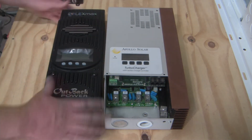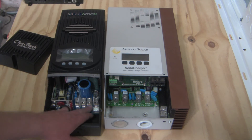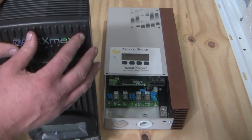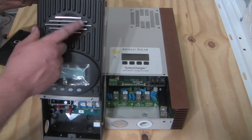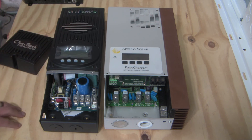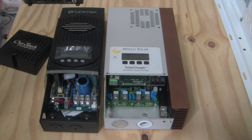For comparison, this is an Outback 80 — it has 150-volt input. I consider it to have pretty good terminals, but they only accept number two wire. Comparatively, look at how much more room you have in the Apollo. And then look at the fan — the Outback 80 has a little fan on top, maybe 50 millimeters, so it has to turn faster. The 60-amp Outback has a tiny fan that's hard to change and it screams. That's my criticism with a lot of charge controllers: the fan and the terminals. I love the Midnight Classic charge controllers but the terminals are really small and closely spaced — that's my biggest gripe with them.